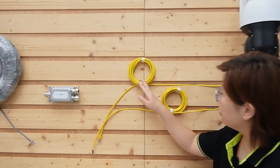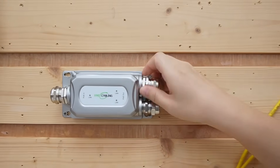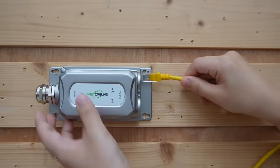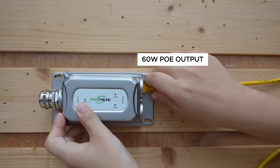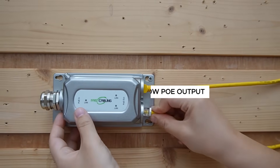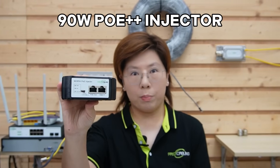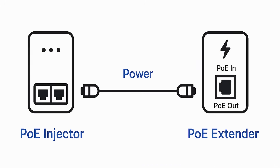It's plug and play and supports gigabit throughput. I'm going to use Ethernet cable and connect to the output ports of our 1-in, 2-out extender — one for our high-power PTZ camera, and the other for our dome camera. Because the extender can output up to 60 watts on one port, we need enough headroom. That's why we're adding a 90-to-95-watt PoE++ injector in front. The injector provides the power the extender needs so both downstream devices are happy.